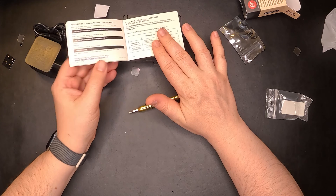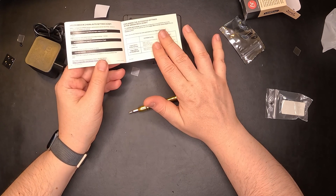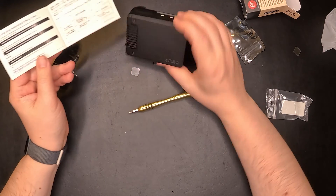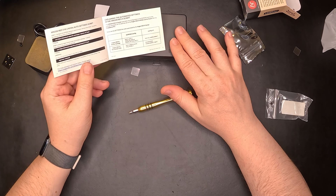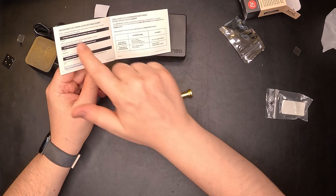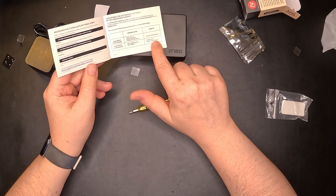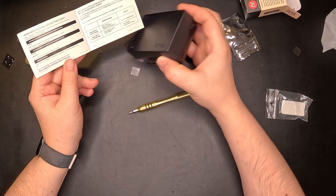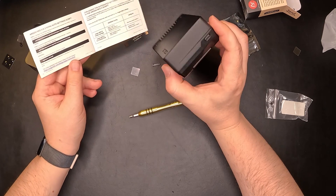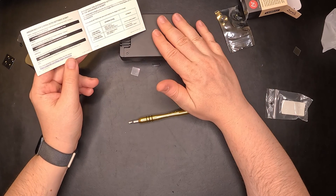On the last page of the manual you will find two scripts that need to be run from Raspberry Pi OS to pre-configure the system to run with an NVMe drive. Since this system was already configured for a top hat, I already had these configurations made — I'm simply migrating from no case to an aluminum case, so I did not need to alter anything. Make sure you run those scripts before closing the case, because you can't access the SD card afterward. Only after that, plug everything back in.